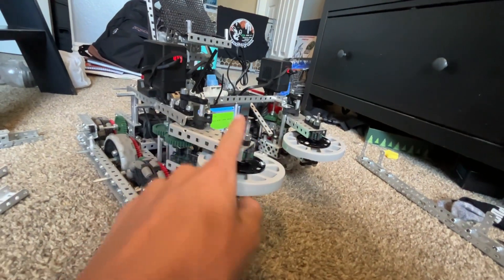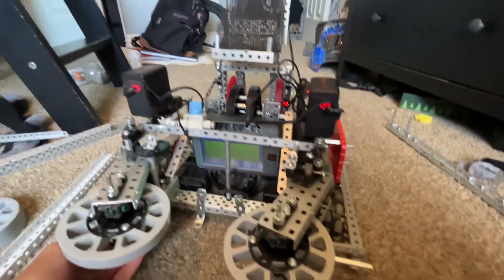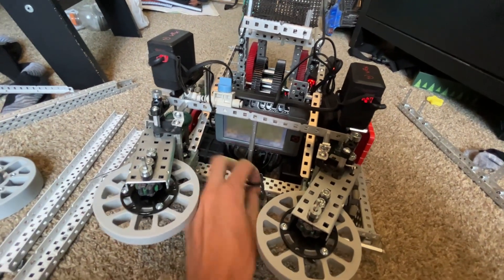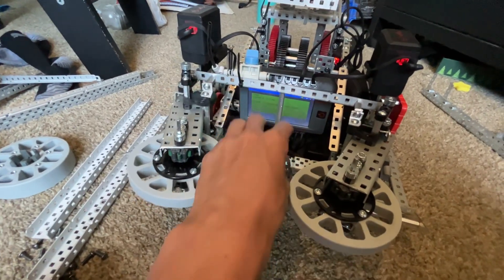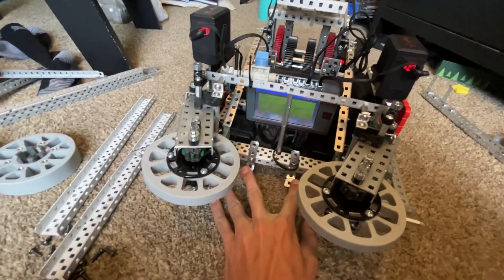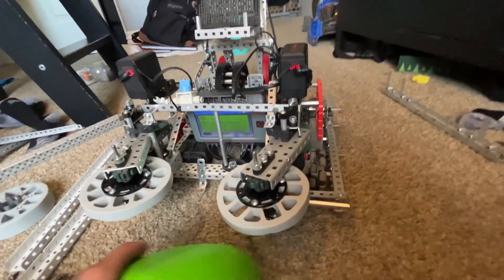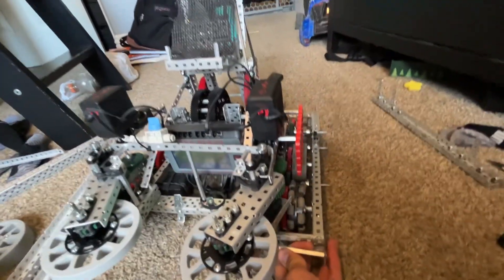We have half-cut flex wheels just for smaller size and a more compact profile so we can fit under the net easier. These axles just have to be cut down and then we'd fit under right away. There's a little bar for bracing and a standoff here. This rubber band we actually used to rubber band our phones to the front to get a POV video, which was pretty fun. These little bent metal pieces shove the ball upwards when it's intaked so we can move it around easier.